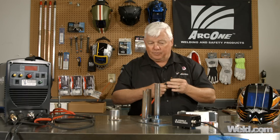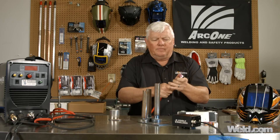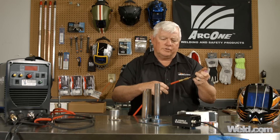Now this particular project, it's just a short-term project, so I'm using an air-cooled version of the 24. That also comes in a water-cooled version. So just know that you can go from an 80 amp torch to a 180 amp torch just by going water-cooled. Same head size. This air-cooled version has a single line to it; the water-cooled has three lines to it.